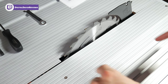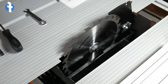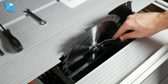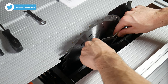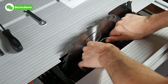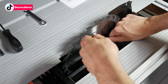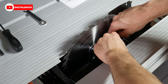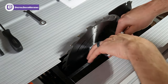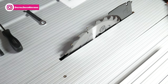To change and remove the saw blade, loosen the three screws on this panel and gently pull it out of place — that will reveal the blade. Take two of the included tools: your allen wrench and the hex wrench. Put the hex wrench on first, then the allen wrench, line everything up, and pull them away from each other to loosen it. That will free it up so you can remove it and take the blade out. When you're done installing your new blade, repeat that process in reverse — push them together and past each other to tighten. Now your blade is secure and ready to go. Put the panel back on and secure those three screws.